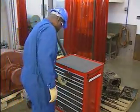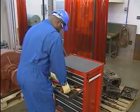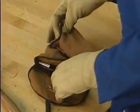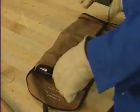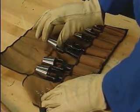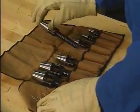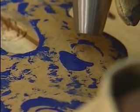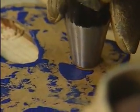When he's finished cutting the gasket to the desired shape, the mechanic uses a hole punch to make bolt holes in the gasket. A hole punch is the best tool for this step because it cuts a clean, precise hole. Well-formed bolt holes are important because they allow connecting bolts to thread easily through the gasket material, to avoid tearing or buckling. The mechanic places the gasket on a piece of wood and positions the hole punch over one of the hole shapes on the pattern.